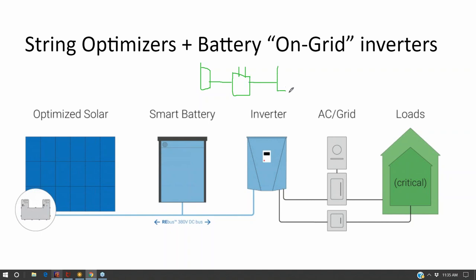and the battery bank goes to the inverter. And so the charge controller is outputting 48 volts nominal. That's the nickname for it. It's actually a little bit higher than that. And then the battery is outputting 48 volts. And if I have another charge controller here, I'm tapping them together. If I have another battery bank here, I'm tapping them together and then going into the inverter. And so you do start assembling your own DC bus bar, whether it be provided to you through a manufacturer, a third-party service panel, or you're buying an electrical box and buying bus bars and wiring them up inside the electrical box on your own.